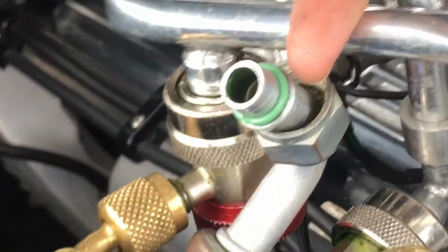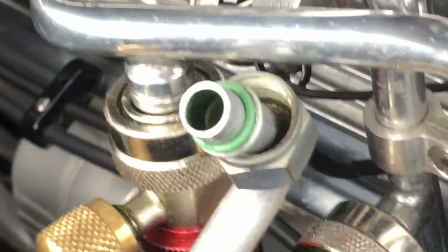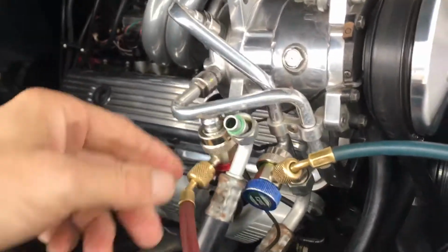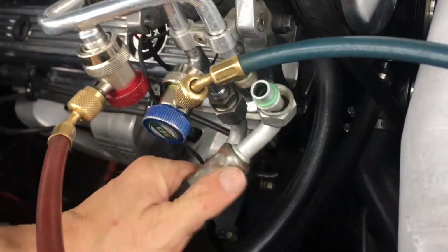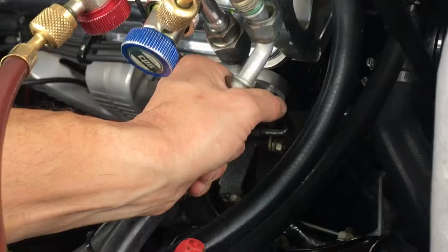So we have NYLOG on the back side of the O-ring, and NYLOG on the back here where the shoulder is going to come down on, where I said it was over tightened, and it's nice flat and sharp from being over tightened on it. And let me back out on my camera, it's too much. Okay, so now I'll be putting it together, and that'll be going up inside there. Let's see if I can do this one-handed.